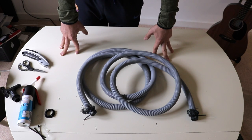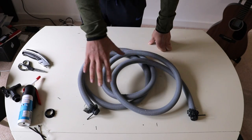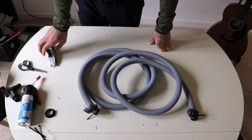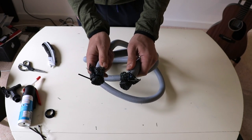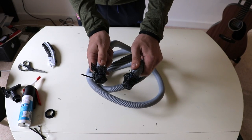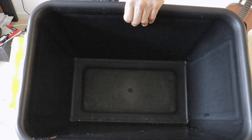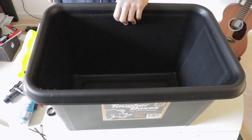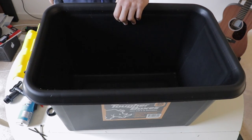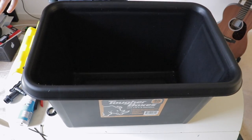What I've got now is the 3.5 meter length pipe with slits all along the whole length made with the knife, and on each end I've attached bits of shade cloth secured with a cable tie - just to keep gravel out of the tube once it's all in. Before putting the pipe in the container, I'm going to move to the second principle: the overflow system - creating a way to drain any excess water out of the system if needed.